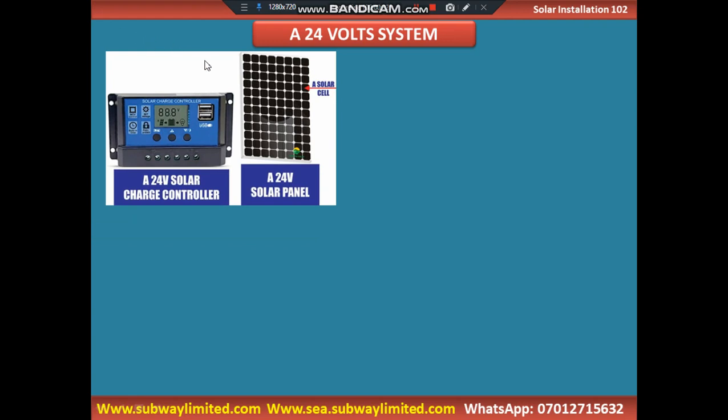We know by now what a cell is. This is a solar cell, and there are 8 in number here, and there are 12 in number here. If you multiply it, you have 96 cells. Each is 0.5 volts. And if you do your calculation, you have a voltage range of maybe 36 to 50 volts, depending on some factors. So this is a 24-volt solar panel.